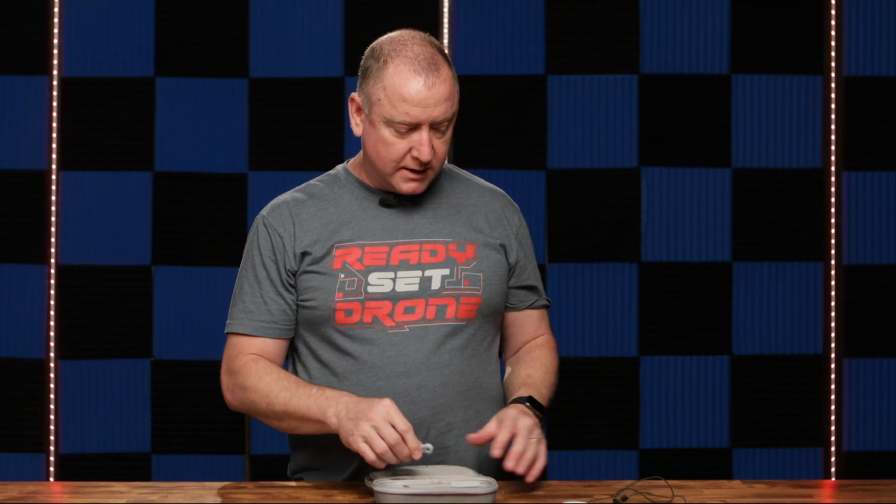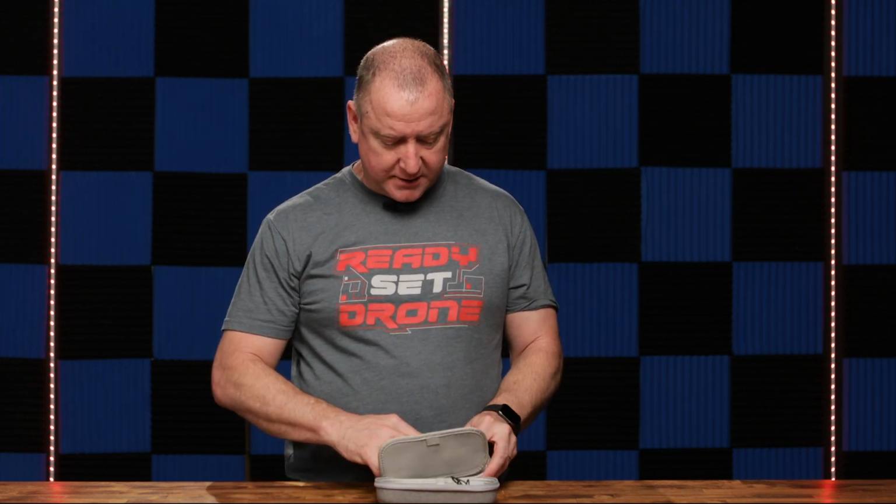Now, what is the purpose of this for flying FPV? Well, with most smaller FPV quads, you're not going to have a great camera, especially if it's an analog signal that you're getting, and it's going to be an analog recording, which looks kind of fuzzy and can have lots of breakup. With this, you can mount it right on top using a very simple 3D printed mounting bracket, which you can buy online as well, where the little camera sits in there, the Velcro strap goes through and holds this thing on top of the quad or beneath the quad, and you're good to go.